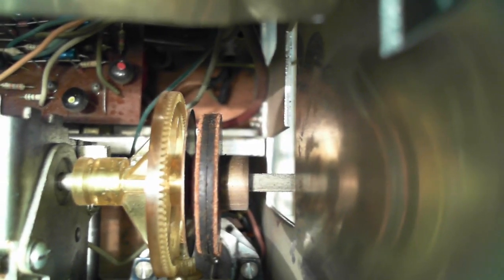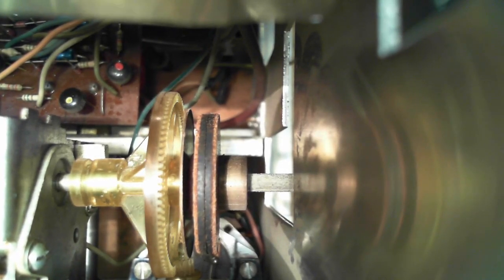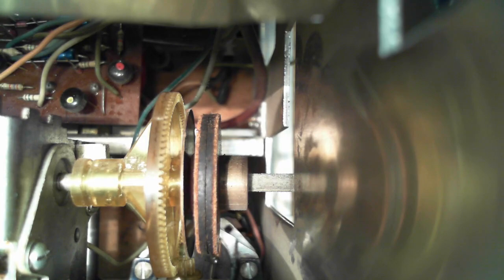No. Typically, again, you would not use a plastic part. And I mean, it does happen, but you put a set screw down there, you can't access it, and a set screw relying on plastic parts, that's not effective. Of course, this thing's not effective anymore. So I would tend to make slots in the yellow gear and then have a fitting slide into the slot.